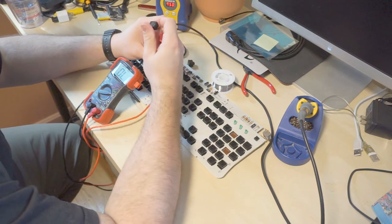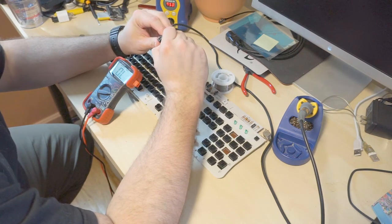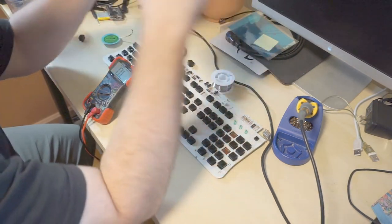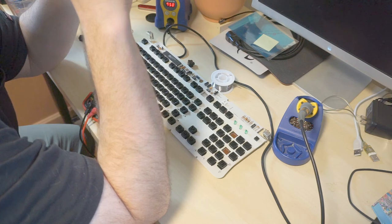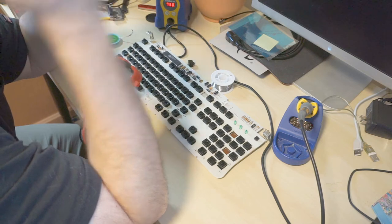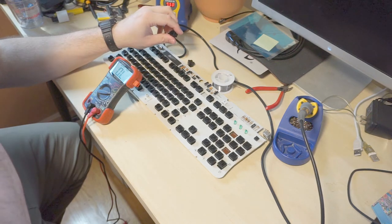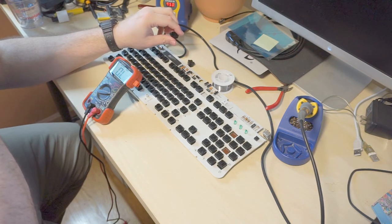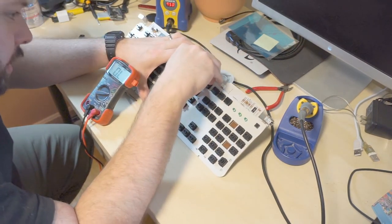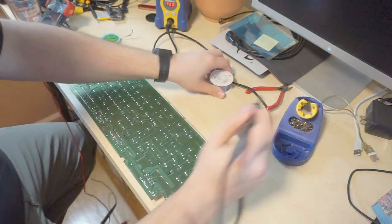Okay, so you're fine. Then the question is, between F11, keypad 6, and equals, where should the working key go? And right now my inclination is to put it on F11 because I have a minus and a 6 elsewhere, and on old Macs, I don't really use any software that needs specifically keypad equals or keypad 6, so the working key I'm gonna put back on F11. I'm just gonna go ahead and solder that in place.